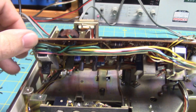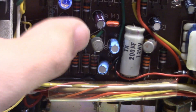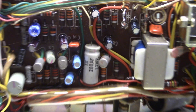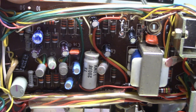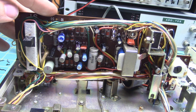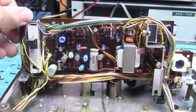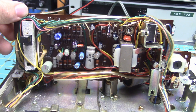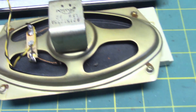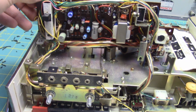I replaced the suspect capacitors. Some of them were still alright, but the grand majority of them were leaky. Some of them were so leaky the meter didn't even register, and others were a little bit leaky but still probably would have worked, though not as good as they should have been. There were a good two capacitors in here that were so dang leaky the meter wouldn't even register, so I'm expecting the amplifier is probably going to be really nice and a lot louder. The speaker is rated at 1.5 watts, so I imagine the amplifier is around the neighborhood of 1.5 watts or so.